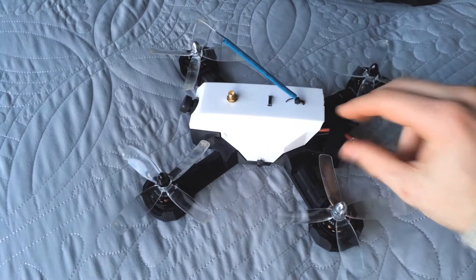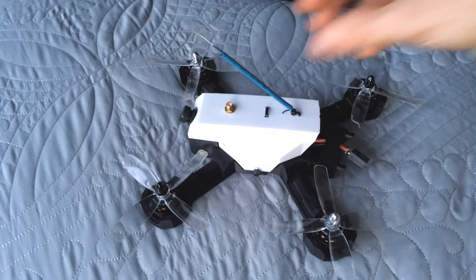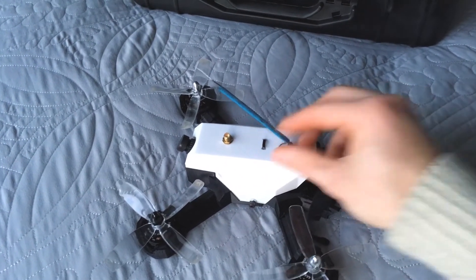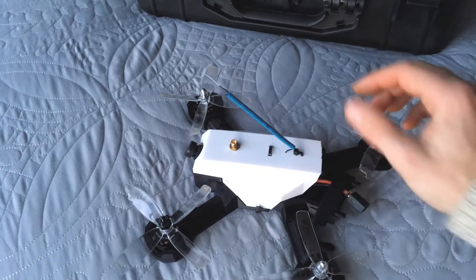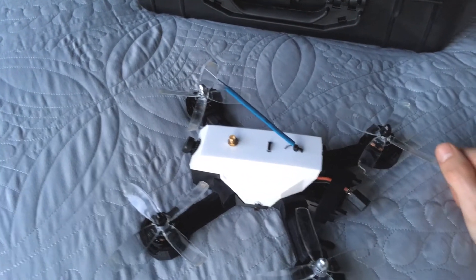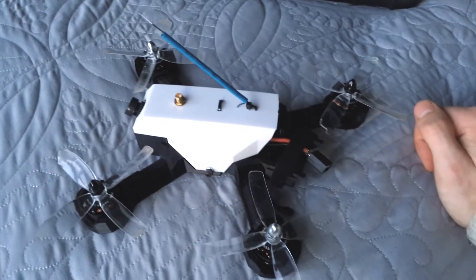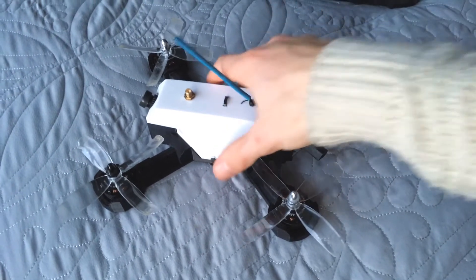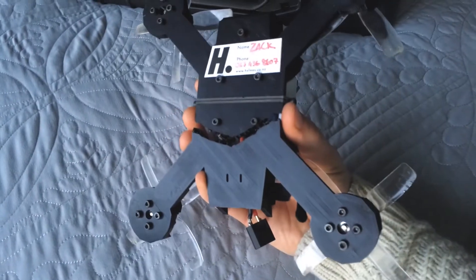I've got a few things in mind to combat that. When I make these last few alterations to the design, I'm going to have the battery sitting on top, the VTX area will probably come out the back, and this area will stick out the front somewhere. It should provide a better balance and better centre of gravity, and I'll also add some webs and ribs in there just to strengthen it up a little bit. The next steps are printing a new frame, putting the electronics in it, doing another test where I actually get it in the air and can show you guys some footage of it flying.